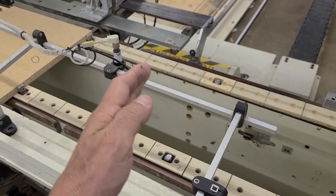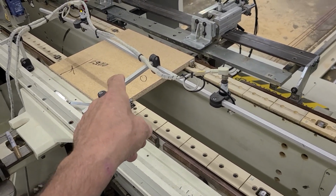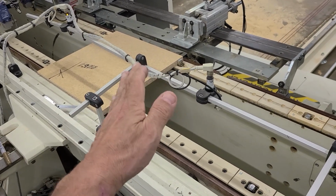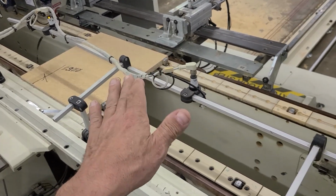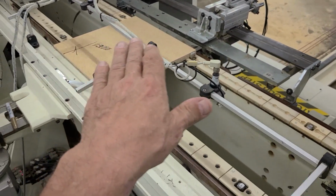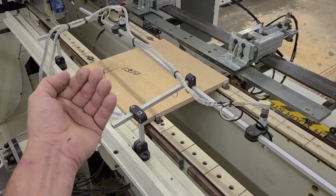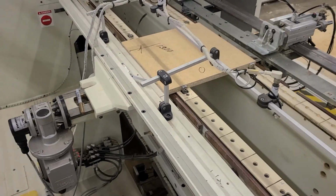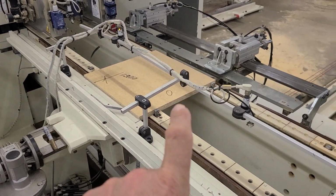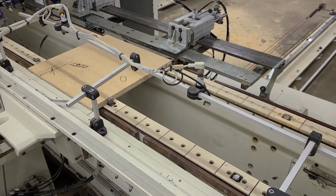So if the chains are in really bad shape and I'm comparing it against a master panel, it won't be as accurate. So if I have to go in and I've got really bad chains, I may wind up running a pair of panels per dog. But typically I can get away with using a master panel, and then my error, instead of being split by double, is just a singular, but it gets me done twice as fast, okay? And depending on the quality of the chain, how much life is on them, and what the customer does, sometimes it doesn't justify the extra effort. Well, that's it. That's all there is to it. It's a nice and simple adjustment.